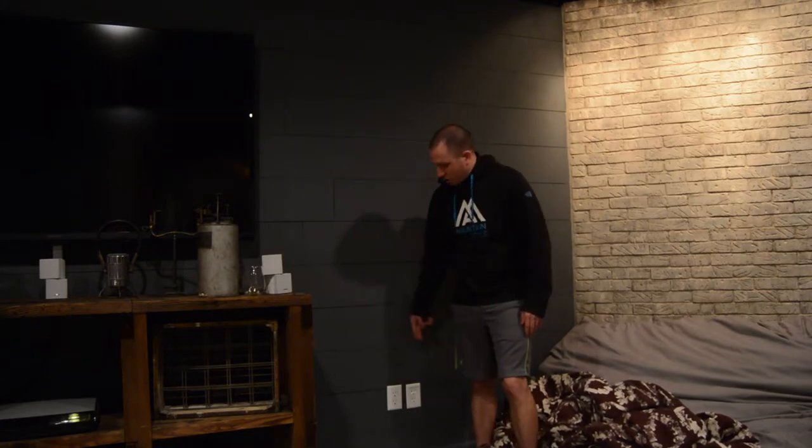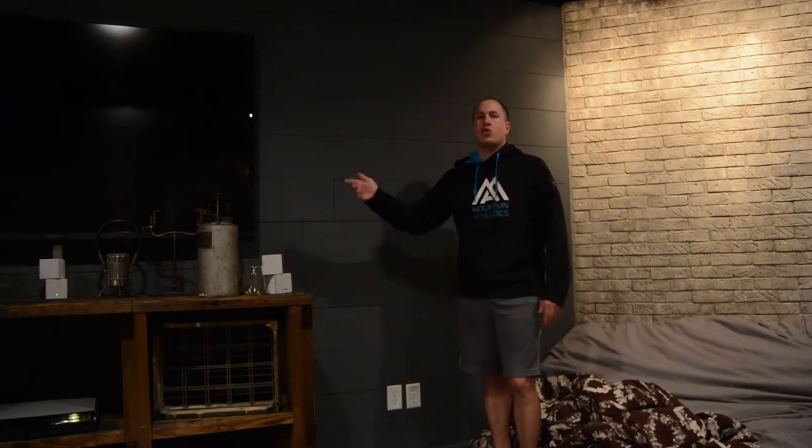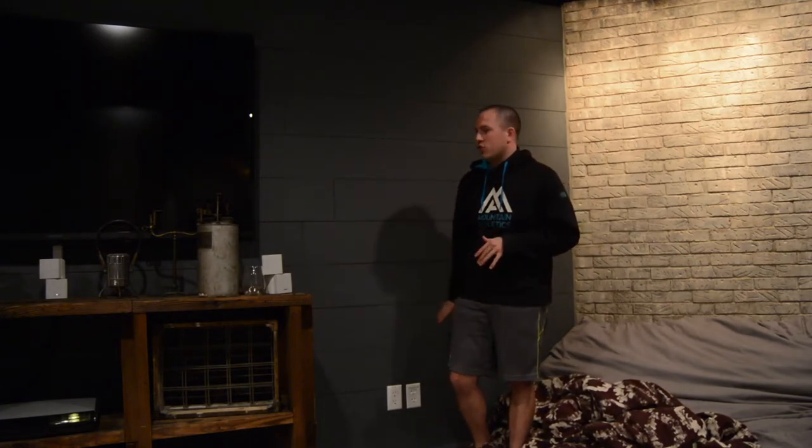If you've been paying attention, I have dedicated 20-amp outlets on this wall — three of them dedicated 20 amps. This is for my two-channel hi-fi setup when I get into big tower speakers on each side, with dedicated 20 amps for all my components. I want dedicated power to get rid of that 60 Hz hum. I ran three separate circuits for just this wall, on top of what I'm already using for the TV, so my TV and DVD player are on a separate circuit than my speakers — it eliminates cross interference that could be detrimental to hi-fi sound.